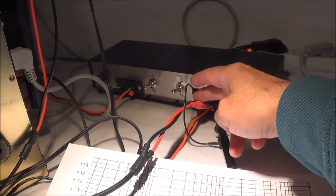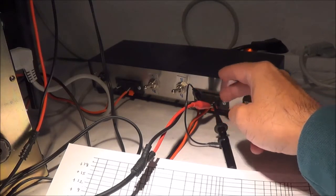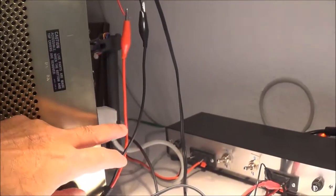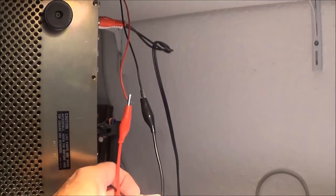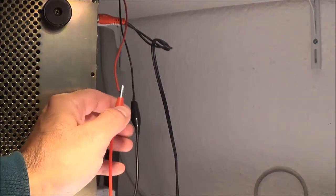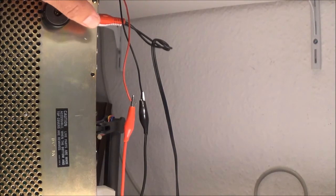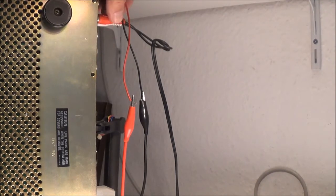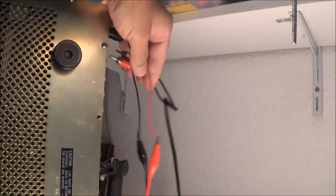And I've got my AC voltmeter leads hooked up here across the loudspeaker terminals, and also I have an oscilloscope just to monitor things. And the signal itself is going to be fed here. Now these are the test leads coming from the audio generator I'm going to be using. It's a combination 3-in-1 unit, so I got a little bit more room here. And I'm going to be feeding this into the aux input, not into the phono preamp input. So my input's going to have to be higher. And of course I can remove this here. I still got the old cable here when I did the preamp test.